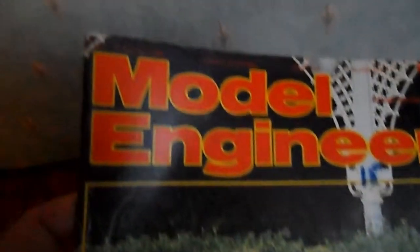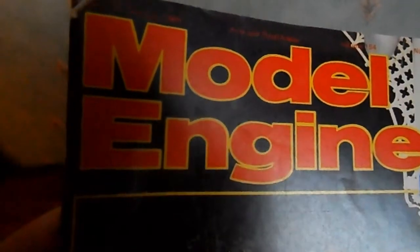Now here, I don't know if the camera will pick this up, but that's the 13th and 31st of January 1985, we have, I think it's slightly different actually, now that I mention it, a multi-stop tailstock attachment for the ML7 with a picture of the completed article there. Now, for those that are wondering what this is for, it's quite simple really. It's just little adjustable threads, a bit of threaded bar with a hex head on them, so you can screw them in and out with your spanner, and there's a nut usually on the back side of it by the looks of it. So you can lock them at specific distances.